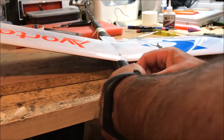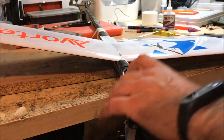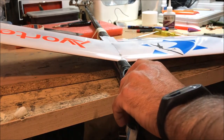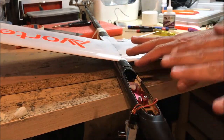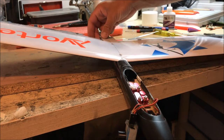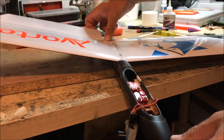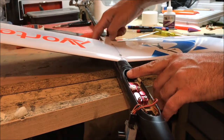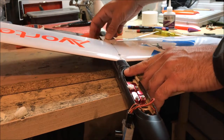I'm looking from the side and checking that the angle is okay, that there's nothing out of the ordinary, and that the geometry looks right. I'm even moving the aileron just to see that it moves freely and that there's no binding anywhere in any direction.